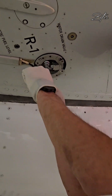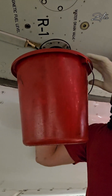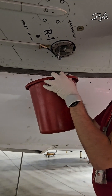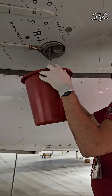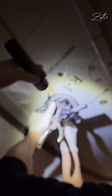Now we can proceed with the draining of the canister by removing the drain bolt from the pump. Inside you can expect something around 4 liters of fuel. If the fuel flow does not stop you must repeat the procedure of opening and closing the sliding valve. But in our case everything was okay, so we proceed with removal of the pump.